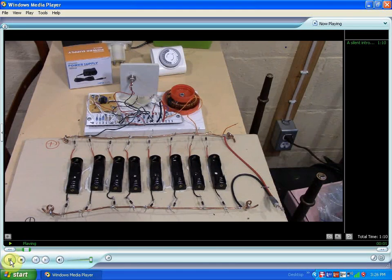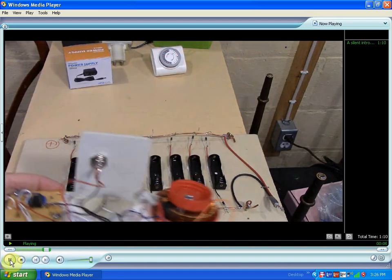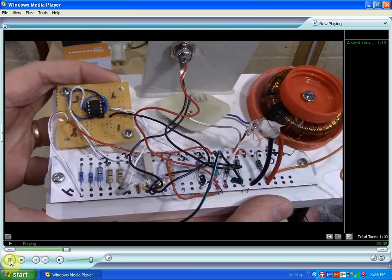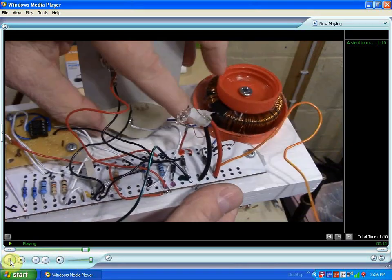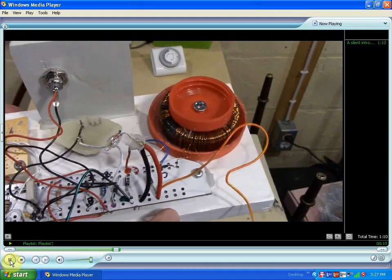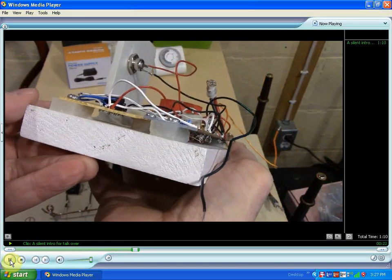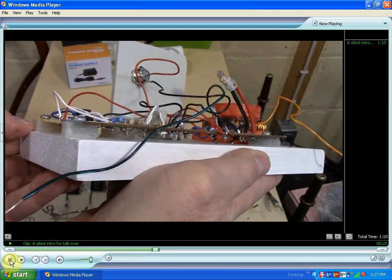This is my alkaline battery charger, a quick build on scrap wood. Upper left is a 555 timer chip. Center is the transistor mounted upside down under the silicone flap, and to the right is a hand-wound inductor sandwiched between plastic bottle caps. Silicone spacers are used under the epoxy board so component wires can be twisted and soldered.